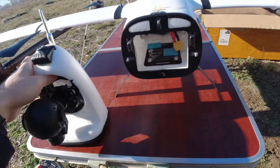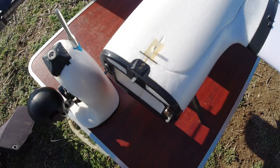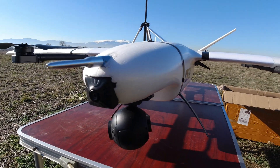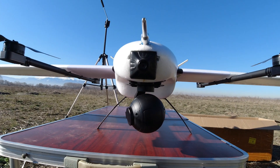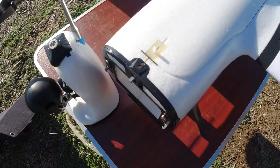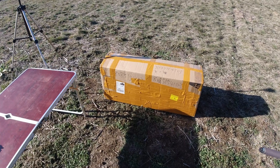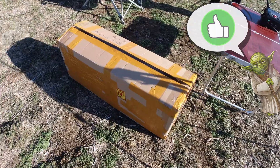There is not a second set of connectors on the other nose piece, but realistically once you solder the cables for something specific it would be highly unlikely you'd have other gear on the other nose piece compatible with the same cabling. You can buy separately a few nose pieces for gimbals to quick swap gimbals, in which case you would also need to buy additional connectors. Moving on — I was not happy with the placement of the airspeed sensor by MFE so I moved mine to the nose, since I am also using a different pitot tube, not the plastic one MFE provide. They suggested making the mount taller but keeping the location, but that would have prevented the fuselage from fitting back in the box. The box is important — it greatly reduces shipping and handling damage.